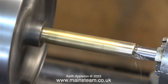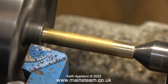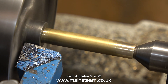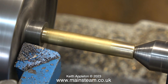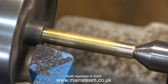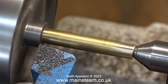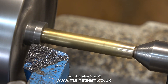I took the brass mandrel out of the chuck, turned it round, and center drilled the end. The live center presses the flywheel against the chuck, making sure everything is in line. Another piece of brass doesn't look very concentric at the moment, but it doesn't matter — as long as the pressure of the live center holds the flywheel against the chuck jaws, it's perfectly in line. I've also changed the cutting tool for this operation, as the chamfer tool was not ideal. Using this arrangement of the live center putting pressure on the brass rod and holding the flywheel securely against the chuck jaws, I can actually take deeper cuts.